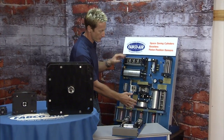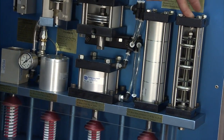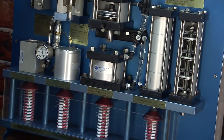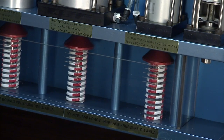Here's a great example of that. If you look on this chart right here, you've got a high-power cylinder — it's three inches in diameter. We've got a multi-power here that's an inch and five-eighths. Believe it or not, the multi-power in a four-stage configuration makes as much force as the three-inch. So the whole idea is to get the same or more power from a smaller footprint, and that's where these things come into play.